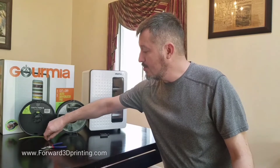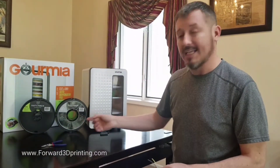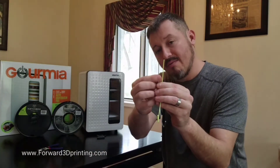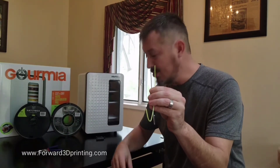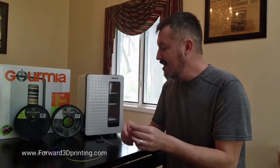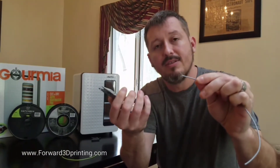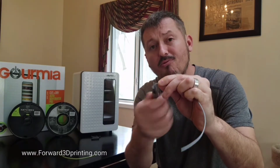In this particular case, I wanted to show you why you want to keep your materials dry. I used two examples of Hatchbox ABS. As you can see, same diameter and everything. The green one happens to have less moisture, and the gray one is nearly wet. The wet one will actually snap — they become really brittle.